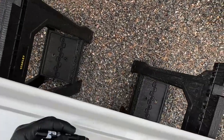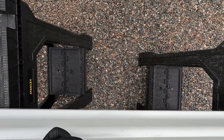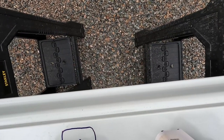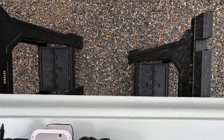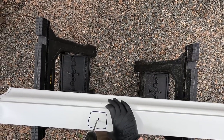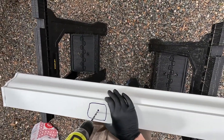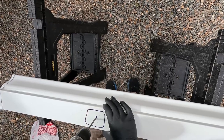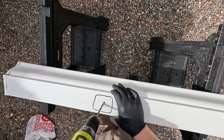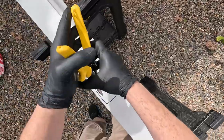This piece is actually meant for plastic or vinyl gutters, but it made a nice template for where the downspout is going to go. So to attach the downspouts I made the template, drilled a hole in the center, cut to the edges, and then just folded the metal out.